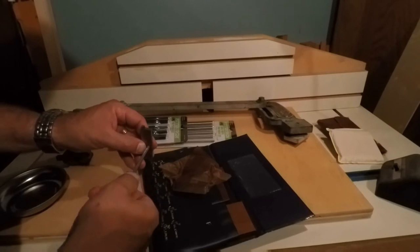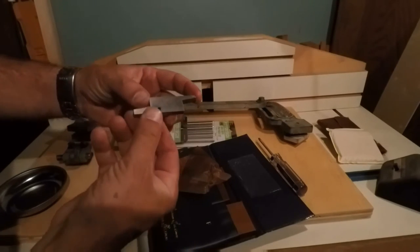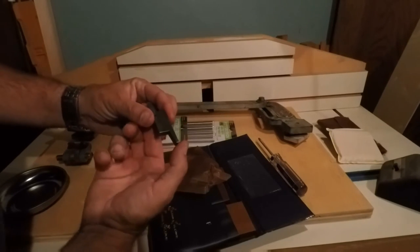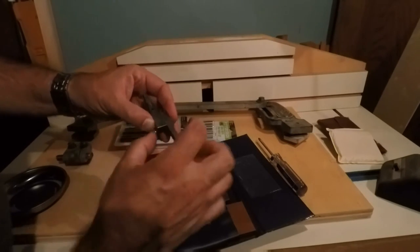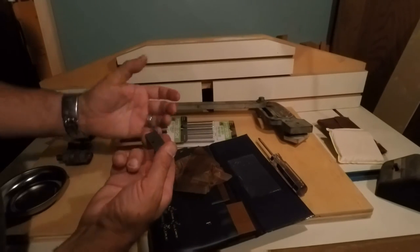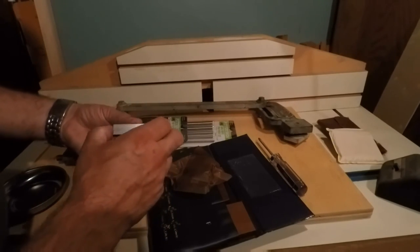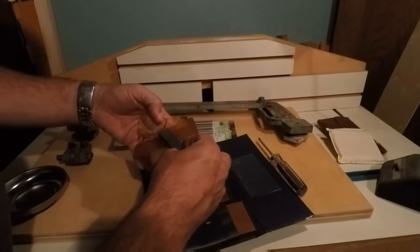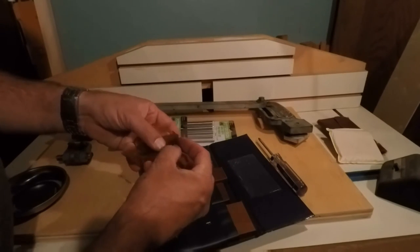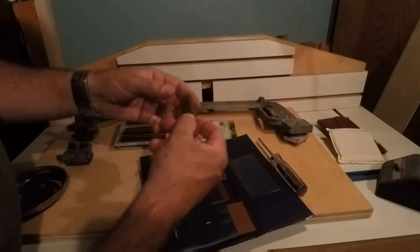Can you tell these are a set of imports? Anyway, there's a dovetail here and it's tapering, so you can put this into a slot, spread it out to where it fits in the slot, lock it, and then you can measure it and get a very good idea of what the size of that slot is — something that can be really hard to measure. You could use gauge blocks or dowel pins that happen to be the right size. Pierre just did a really good video on how to measure the inside of a large ring with some gauge blocks — you might be able to use this in that kind of setup too.